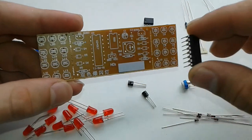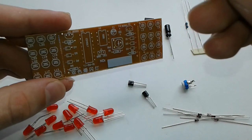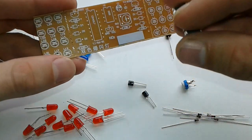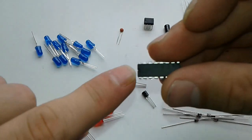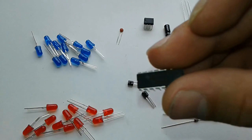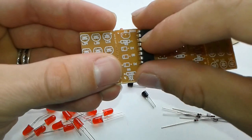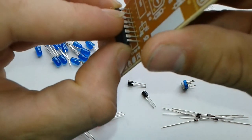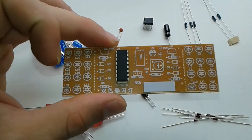Let's get started. I'm gonna start first with this chip — this is a CD4017BE. I'm gonna put the links down below and some pictures. As you can see here, it's got a small notch in the front of it. This notch is gonna go here. Alright, we're gonna adjust the pins to fit these tiny holes. Managed to put it in.